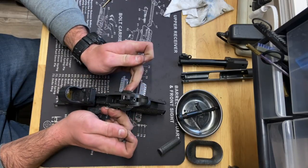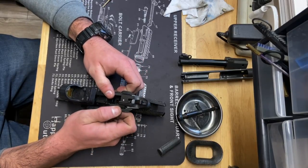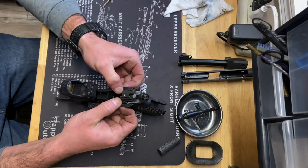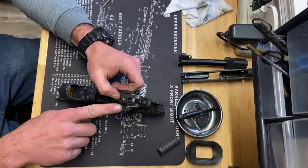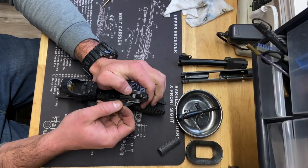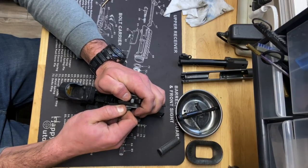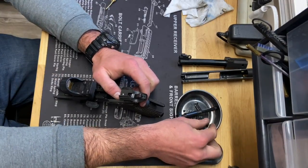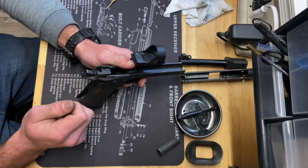At this point, the safeties need to come apart so you can remove all the internals. These come apart at about halfway in between engaged and disengaged. The easiest way — as I face the frame towards me — is to get it at about the halfway point. Make sure you put your hand or finger on the back side of the safeties, because there's a spring that's going to want to shoot out of the back of the gun if you don't. Get it about halfway in between and give it a little wiggle. You can see that spring flies out — if you don't cover it up, it wants to shoot across the room. Sometimes with newer guns those safeties come apart a little more difficult, but as you do it a couple times it gets easier.